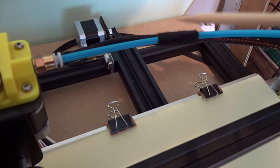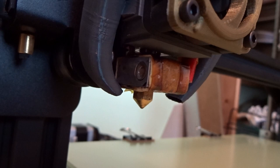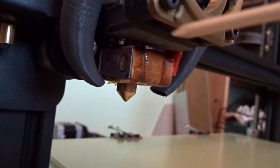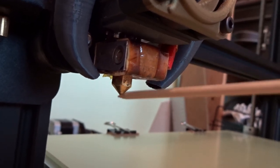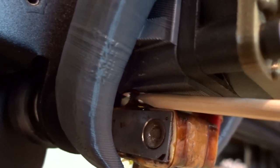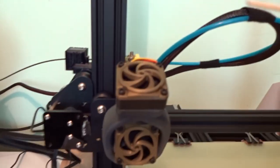The Bowden tube on mine is a modification — a custom high-temperature tube, so I can use high-temperature filaments. The standard one will only do PLA and PETG; you can't do ABS or anything like that. The Bowden tube goes all the way down into another Bowden clip and then into the heater block, into the hot end. This is the cool section of the hot end, and at the bottom is the hot end itself — the heater block. Cool filament travels down and when it reaches here it turns to liquid and squirts out of the nozzle.